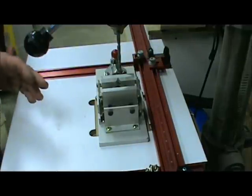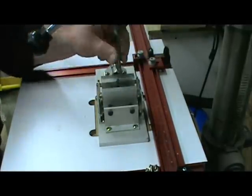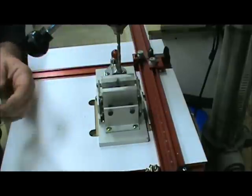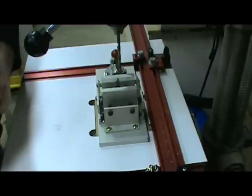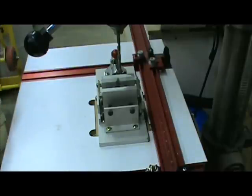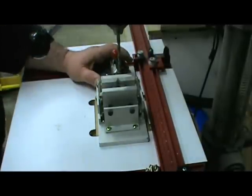The first hole we're going to do is go right down through with the 1/4-inch bit so it drills through our segmented piece. We didn't mention the 1/4-inch bit earlier, but add it to the list of materials you need. You need a 1/4-inch bit to chase the original 1/4-inch hole.